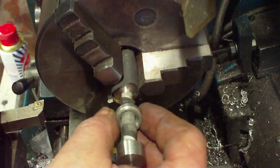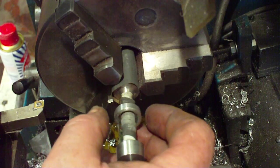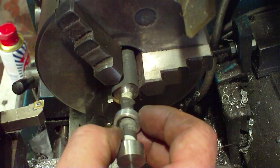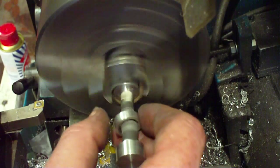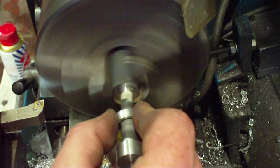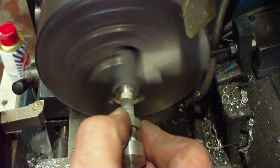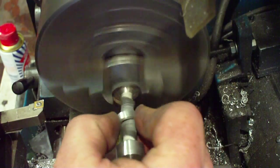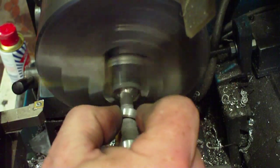Here's how we're going to clean up the centre bit. It's some double-sided tape on the shaft, and I've got some 400 grit on here now. So it's just a case of — the tape's just there to hold the grit into place — and we just rotate this and it cleans up inside. Then we'll use a finer grit a bit later on.